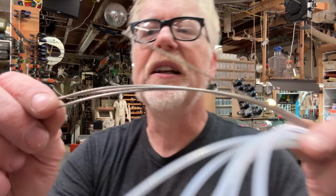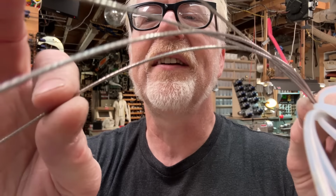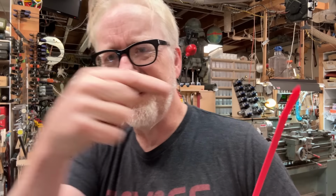We all use the basic building block of modern animatronics every day when we ride our bicycle, because our bicycles often have cables for braking. And when you brake here, you are activating a lever force on a piece of braided steel cable. This is some very nice braided steel cable, which is called swaged because it's been rolled. It has a very smooth outside edge. So you pull on a piece of braided steel cable, and it is connected to you by a lever, and it's connected at the other end by a lever. And in the middle is a tube that holds those two levers in tension with each other. So when you activate one, you activate the other. You pull on the brakes here, and this clamps down on your wheel.